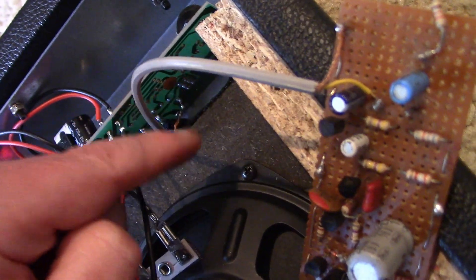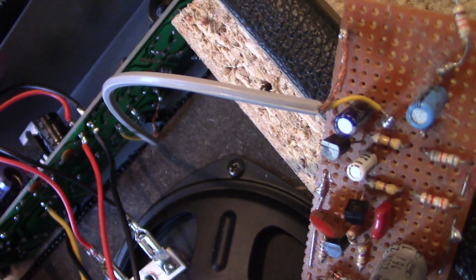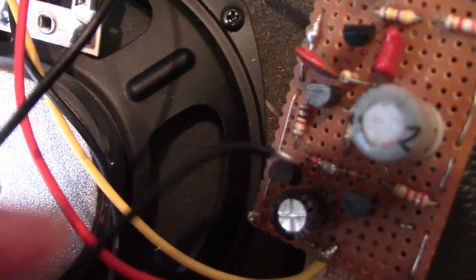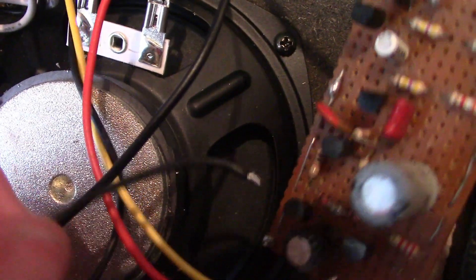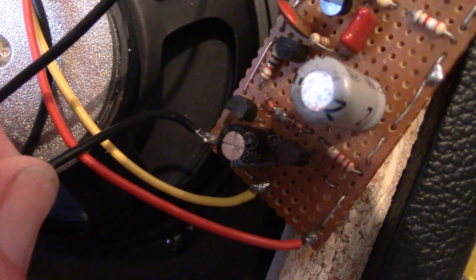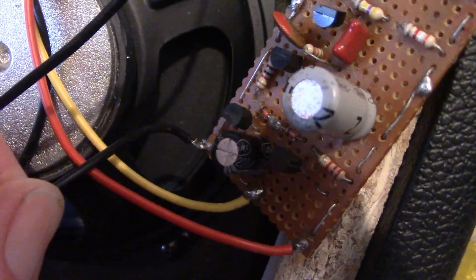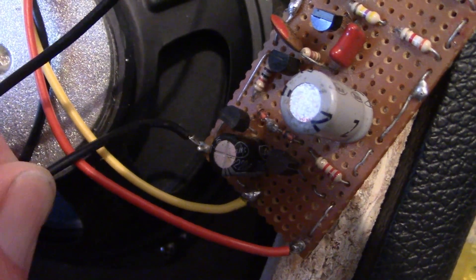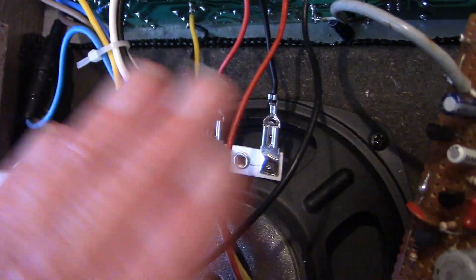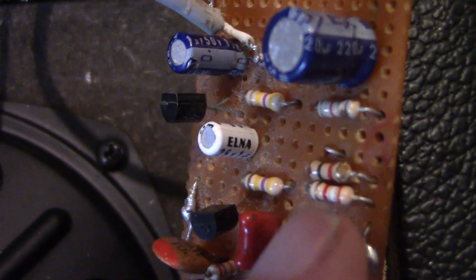I've made some changes, making connections more direct — it's a little quieter but still not really satisfactory. Shortening the wires a bit more reduces the hum a little. There's quite a long wire from another earthed part of the circuit, and when I connect it, the hum is actually a little louder — it seems we might have an earth loop making the hum worse. That can be an issue especially in the presence of AC current like we have here.